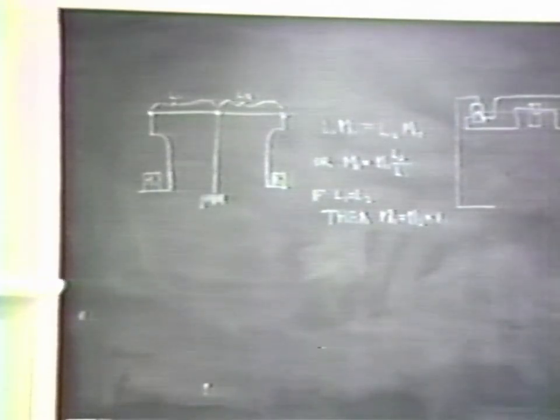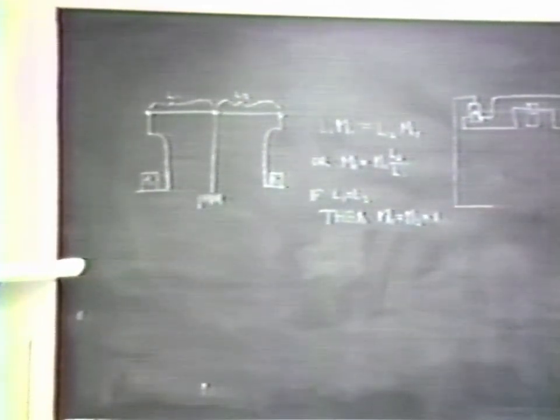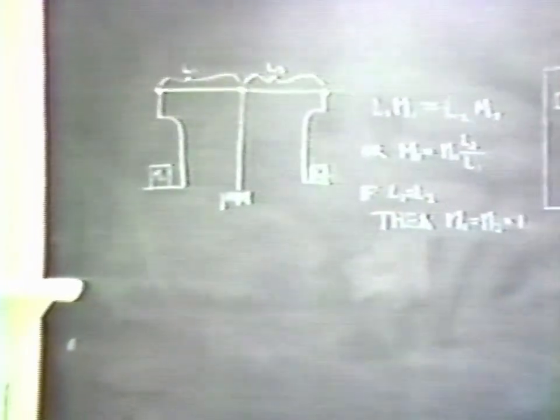In fact, this is not practical, since in an arm length of 12 inches or so, the ratio would have to be within 1.2 microinches. As a practical matter, the ratio can be adjusted to within about 5 parts per million. Therefore, weighing techniques must be used which allow for this ratio.